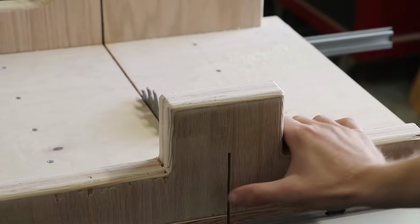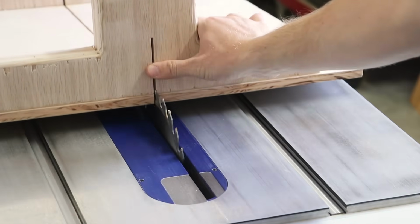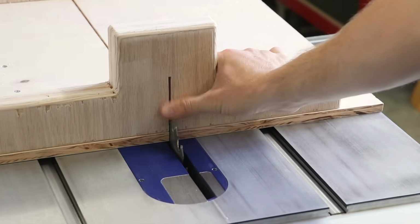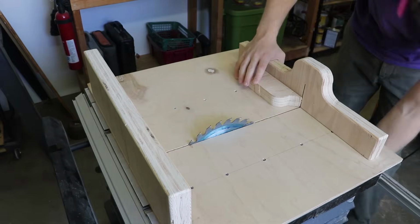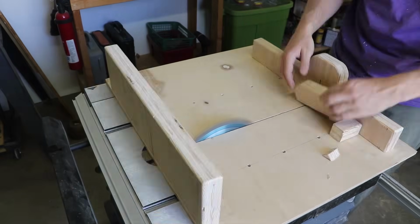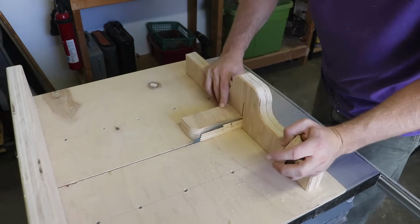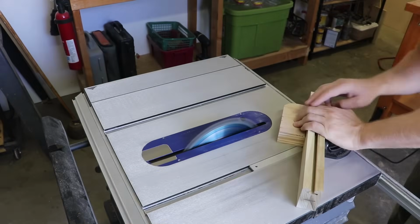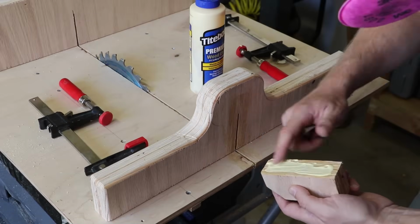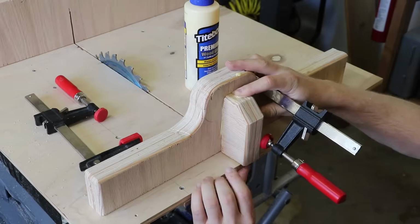The saw slit on the fence poses a perilous risk as it is easy to place a thumb over it while operating the sled. I'm demonstrating this with the saw off on the back end. Trimming down an offcut, I made a simple blade guard. This will make it harder to accidentally place my thumb over an area where the blade can protrude from the sled. It is attached with only glue, and it is only glued to the fence to allow the fence to be adjusted.